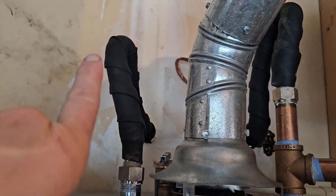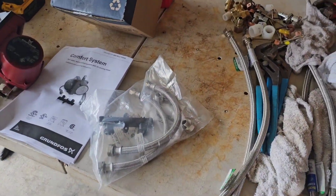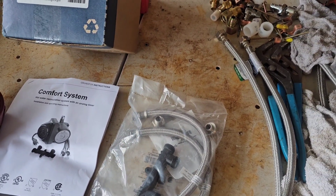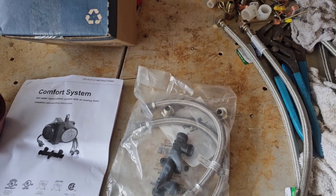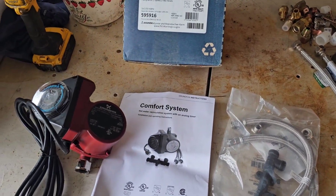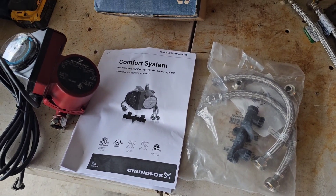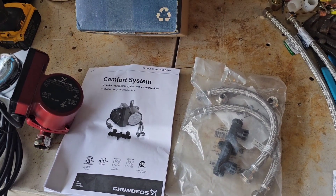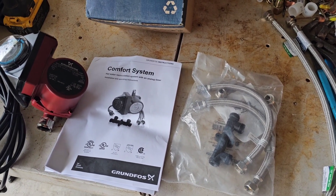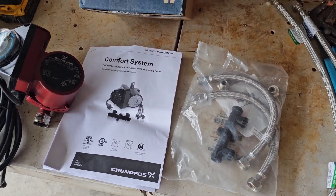The direction of flow is going to be towards the house, pumping towards the bypass valve. I haven't even been inside yet, so I'll walk inside and ask the homeowner. She doesn't use the far left sink — it's a double sink in the master bath — so we're going to put the bypass valve over there. It doesn't really matter which sink, we're talking milliseconds difference, but drawing hot water to that area will benefit everything in that room. Every minute 30 seconds.